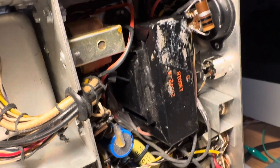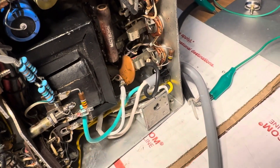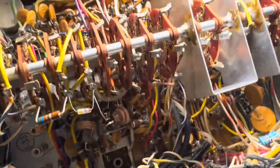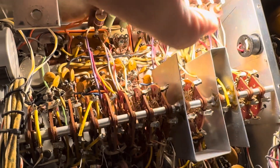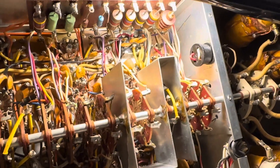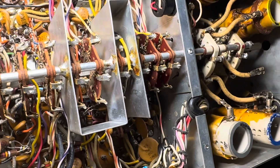I'm probably never going to figure out why my power supply runs over voltage, but I can use it the way it is on a variac so I guess I don't care that much. I had to put some resistors in here for the B plus — when I first got this thing the B plus was shorted somewhere. I moved this metal piece and got a short, and I eventually put 12 volts and some high amps in and blew the short out. I'm not sure what was wrong but the rig works, so whatever I did it fixed.